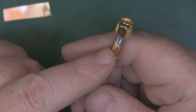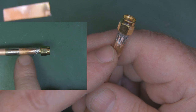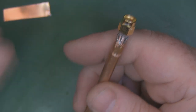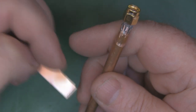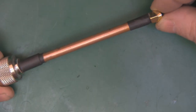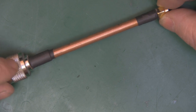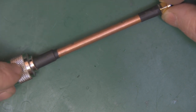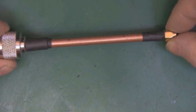The first two I made I used a crimp-on sleeve over the top plus a little heat shrink tubing to protect them, but with the soldering method I've just shown you, you don't really need that. I've come in with the Dremel to tidy it up, and I'm going to use some copper tape to wrap around there, then cover it all with heat shrink tubing. This is the finished coax — the SMA connector is now on there permanently, really strong. The other end has a crimp-on N-type connector, and I used the sleeve on that one to add a little more strength since it's bigger and heavier.